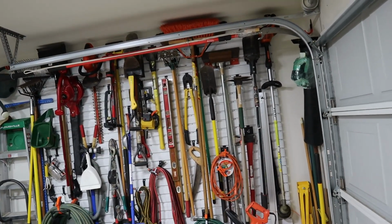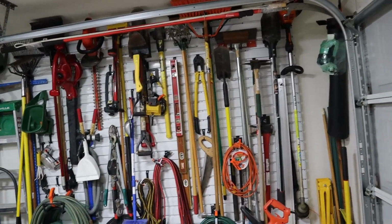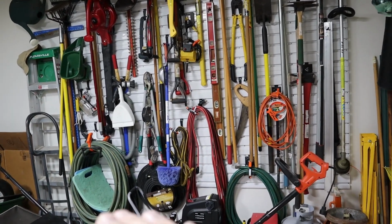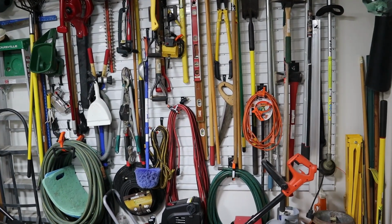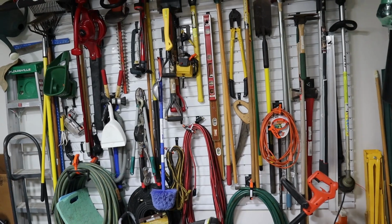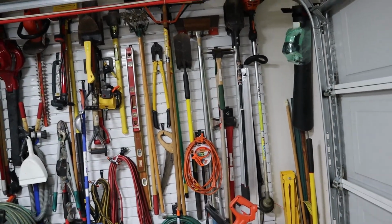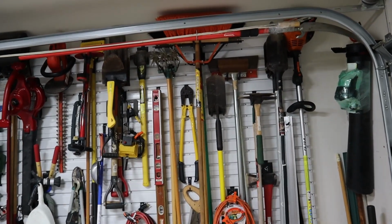And then I just went and hung it. It took me maybe 3/4 of a day to get it hung and everything put on there. So it's a real easy project. I just started off from the floor and drew a level line, and that's where I laid my first panel. And from there, just stacked them one on top of the other and drilled screws right into every one of them. I pre-drilled every hole in the Gearwall plastic and then just sunk them.